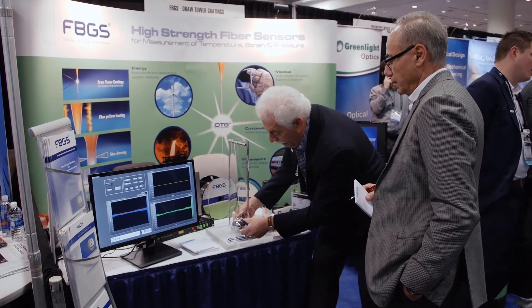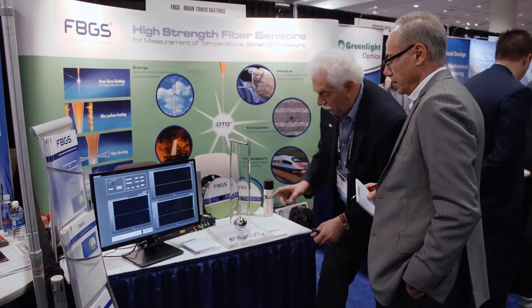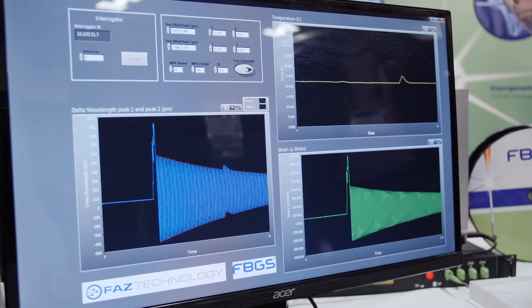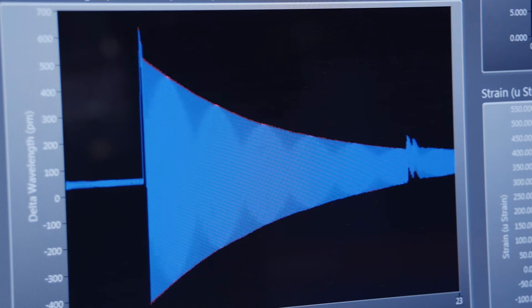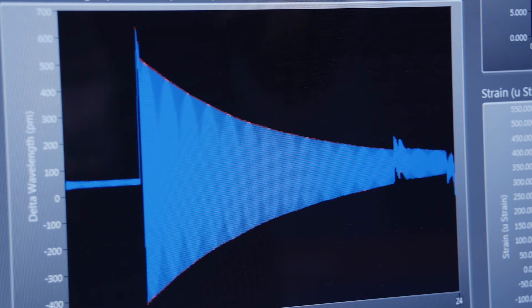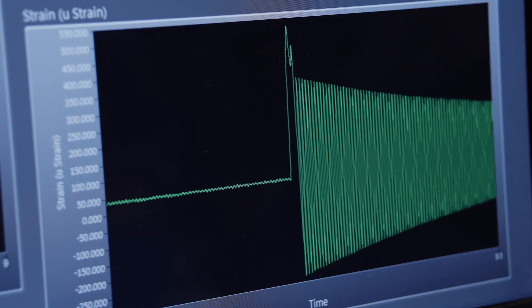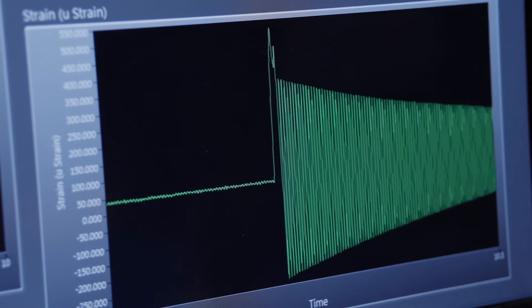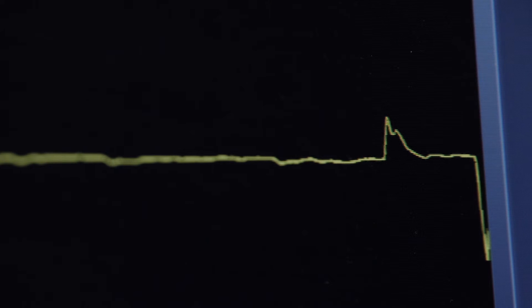As you see from this demo, as I move the ball that's loading the fiber here inside this tube, the fiber is strained under compression and stretch. You see the signal showing on the left screen where you see the combined signals. Our unique sensor has the capability to separate and decouple these two signals, as you see on the right-hand screens. The lower screen is simply showing you the strain alone, while the upper trace is basically a temperature trace.